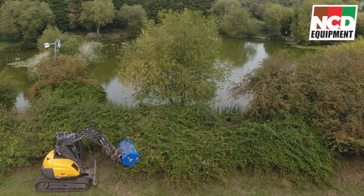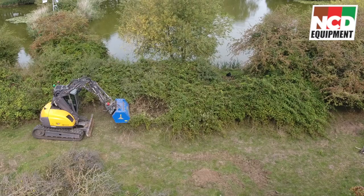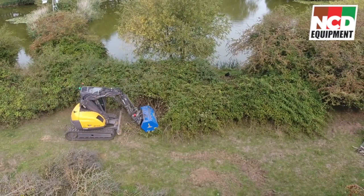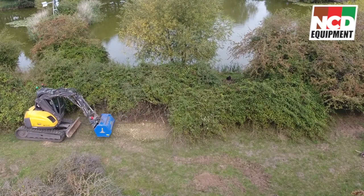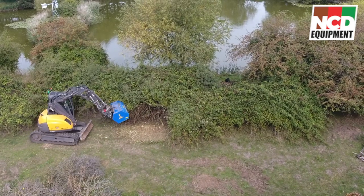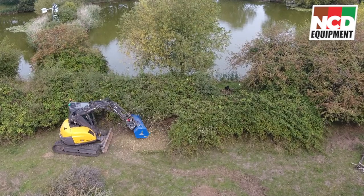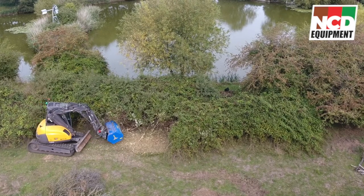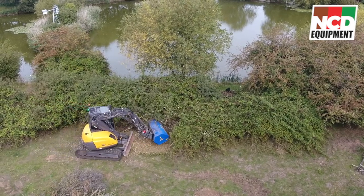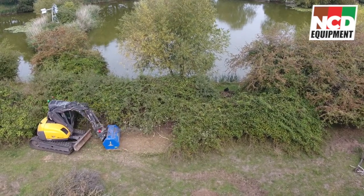The more and more time I spend in these Mecalac MCR range of excavators, the more I'm getting super impressed with it. Every time I get in it, I get out and I've got a smile on my face because they're so responsive. So you can track there, and as soon as you lift it up, you don't get that annoying thing where the machine slowed down and you lost the ability to slew or to lift your main boom up. I'm running a skid steer stroke excavator attachment, which is for excavators up to 10 to 15 ton, on an 8MCR, which is equivalent to an 8 ton excavator, and I'm able to have that flow going at full speed, still track and actually lift up without losing too much flow to the head. It's phenomenal. You can get so much work done.